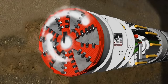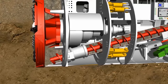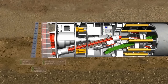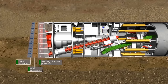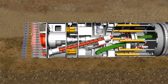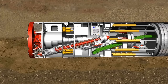If necessary, the consistency of the soil can be modified with foam to produce an ideal paste-like soil. The opening for the screw conveyor, which discharges the material, is in the invert of the excavation chamber. Operation of the machine is such that the earth and water pressure on the tunnel face and counter pressure of the ground in the chamber are balanced. Adjustment of the advancing speed and conveying rate of the screw conveyor makes it possible to control the balance of forces. As a result, there is no variation in the earth pressure and the support required at the tunnel face is generated. Earth pressure sensors in the excavation chamber continuously monitor this balance, which is also controlled by the machine operator.